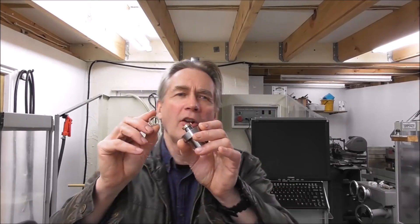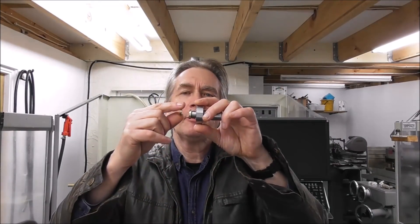Hello again, it's Cliff here from down under. In my recent video series on Rapid Turn, I've gone over the advantages of gang tooling and how you can run Rapid Turn longer unattended through various tool changes. In this video, I'm going to use multiple part work offsets to produce these little nuts — not just one at a time, but machine multiple parts on the stock. I'll make four at a time so the job runs unattended for four times as long.